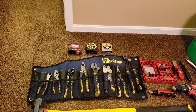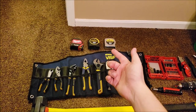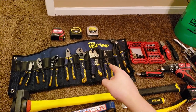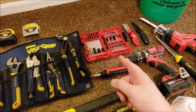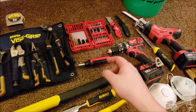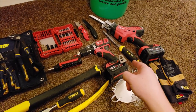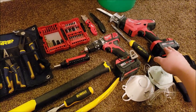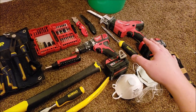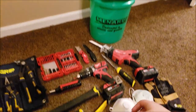These are some of the tools you may want for the preparation and demo stage of the remodel. We have a tape measure for measuring things out and calculating square footage for materials. We have some hand tools — especially a crescent wrench and needle nose pliers. Over here we have some drill bits and a drill to go along with it, a screwdriver, a utility blade, potentially an actual knife, a jab saw, and a powered hacksaw — an awesome demo tool.